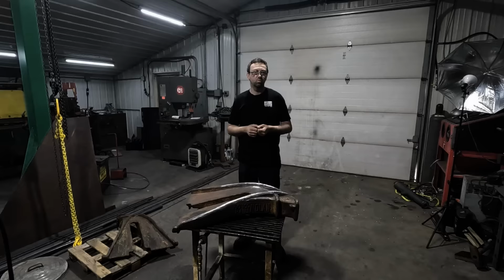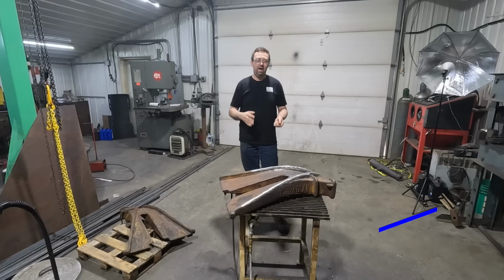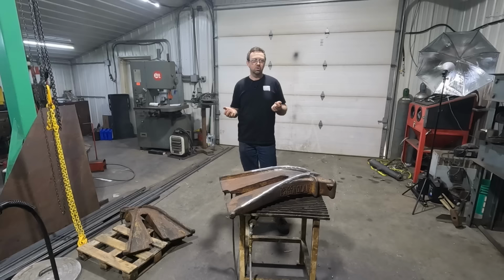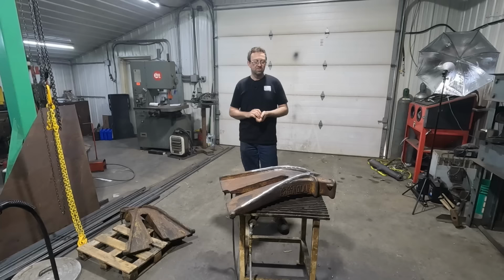And now you're probably all going to ask, when are we going to get to see a derailment video? You're not. Derailments are already a high stress situation, a lot going on, and everybody already feels bad that it even happened. Generally everyone I've dealt with has been 100% an accident, act of God. Usually it's ice over the rail, a track that doesn't see service at least twice daily. I've seen where the train went through the day before, it rained, it snowed, covered over the rail, and then the next morning they went over it and went in the ditch. I've seen it from snow plowing, the plows on the highway, plow it into the crossing and you push through it nice and slow, but you still go off because of the ice. So it's already a bad situation. So I'm not going to film derailments just because of that.